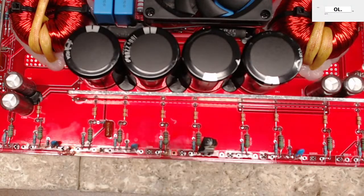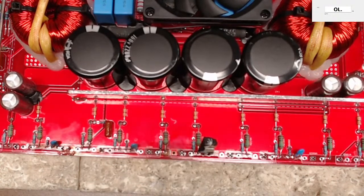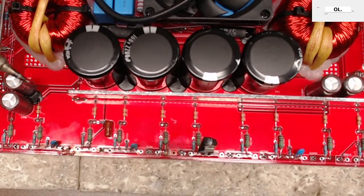What does the hertz matter for diagnosis? You're talking about the frequency of the scope itself. So let's say you had a scope that's only good to 20 kilohertz. Well, you have switching in Class D amplifiers that is higher than 20 kilohertz, so you would never see it. You have to make sure that your scope is within the specifications of the frequencies that you're actually testing. Like most power supplies run at, what, 27 kilohertz. So you have to make sure your scope is at least good to 27 kilohertz.